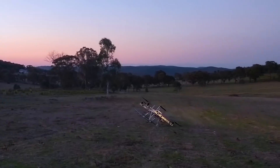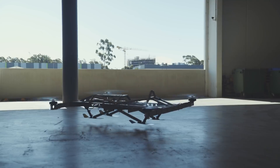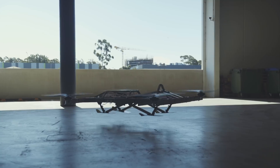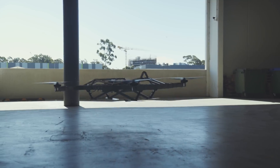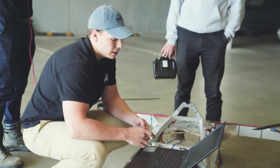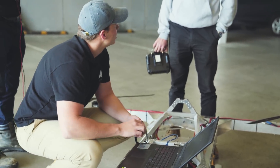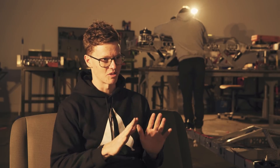So we came back here to test some more things. We've been testing all morning and we just had our test. We thought it was interference with the signal cables to the ESCs — the electronic speed controllers, the things that basically regulate power to the motors. We shortened that signal cable significantly and that appears to have worked, which is good because that was our last resort.